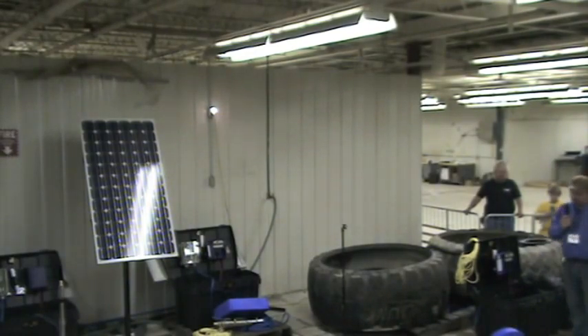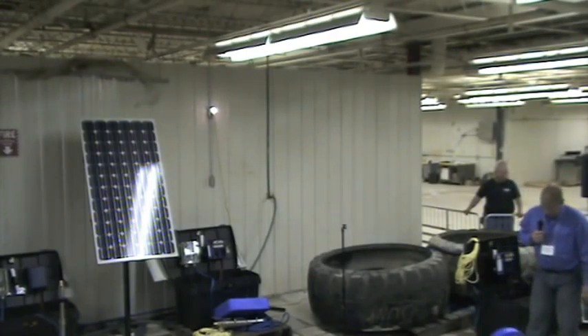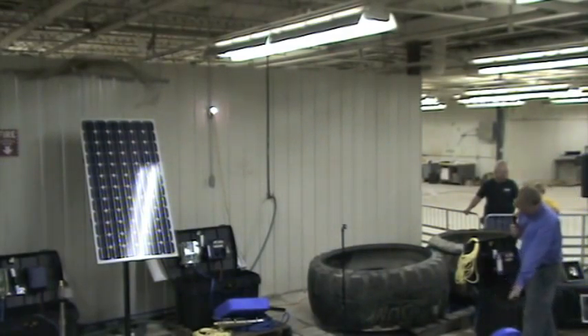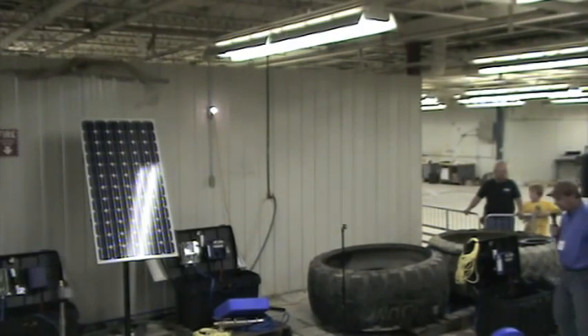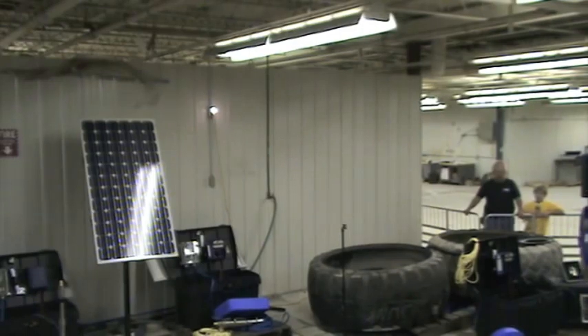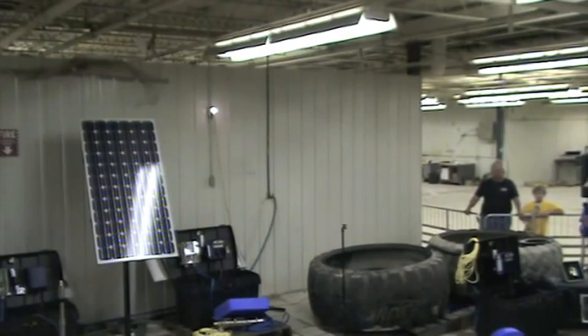This is a new product we're looking at — it would go around your tanks to firm up the soil. On a new install the ground is hard and level and looks great, but after three weeks of rain, it's a big mudhole. The easiest approach on install is to have a level pad with gravel, sand, or dirt, then interlock these together and build it up with sand. It creates a solid pad for cattle to walk on — all the little pockets hold the soil, and any rain, manure, or runoff goes through the sand. Just an idea to help on a new install or fix an old mud problem.